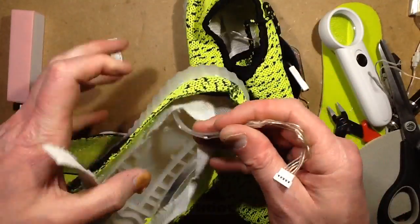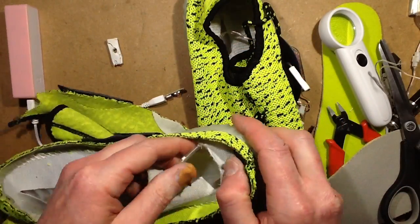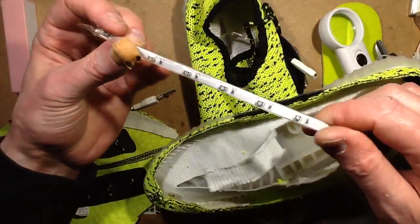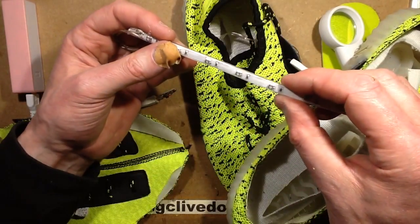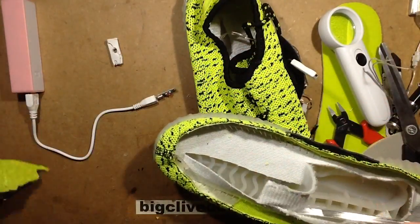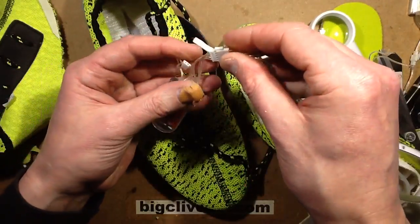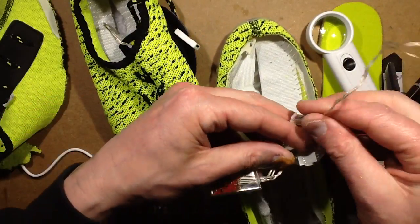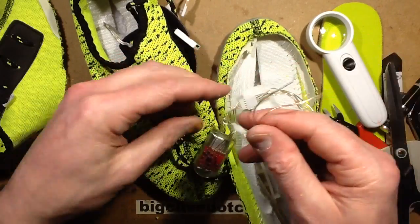But what we can see here of the strip is it's a circuit board, quite a rigid circuit board I have to say. It's not soft at all. Can I get that out a wee tad more? Yes, I can, by using the power of force. So here's the circuit board, which has the little red, green, blue LEDs, quite a small package, with a resistor per LED by the look of it. And when it's plugged into the module, and enabled by shorting it out, let's plug it there and there. Quite clever the way they've got a 2-pin connector to enable that.